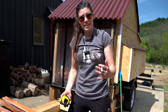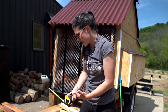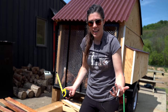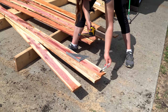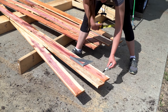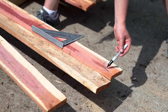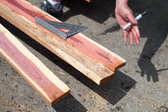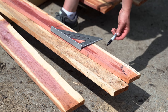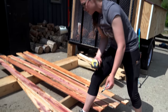One thing about using this lower grade lumber is that you do have to be a little bit more choosy as you're making your cuts. But again, because it's so affordable, it's okay to throw away bad little spots. There's a little crack right here — I could still get my seven-inch piece and be free of that crack, but because this wood is still wet, I'm going to want to avoid it cracking further as it starts to dry. So I'm going to go ahead and cut it all the way back here, and I'm still going to be able to get several pieces for the planter out of this board.